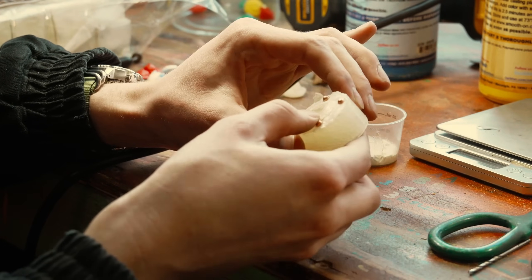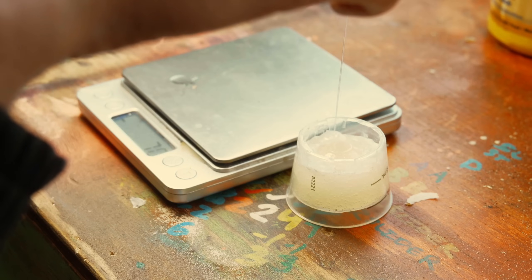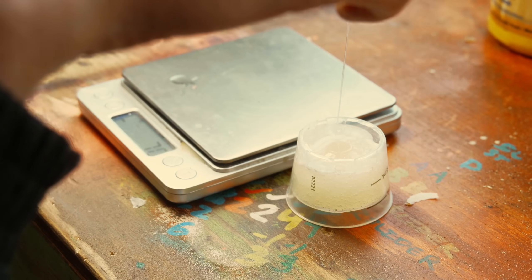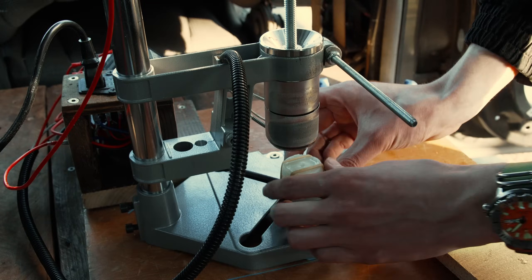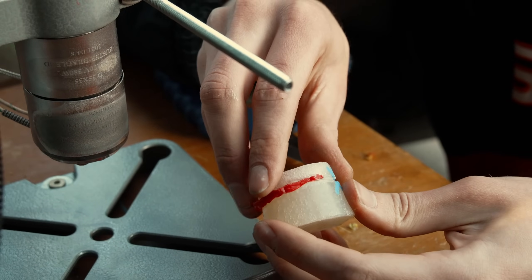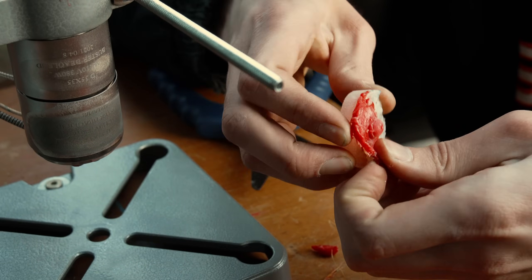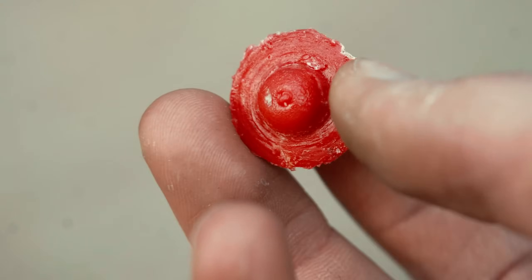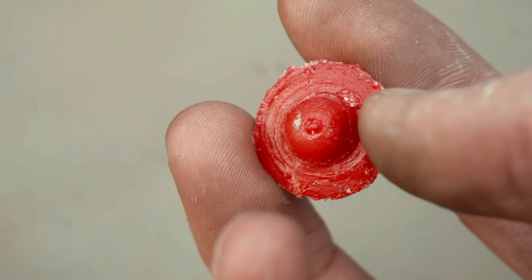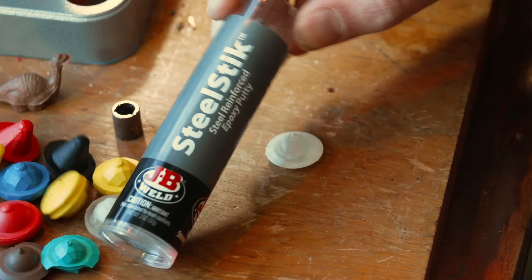It's possible that the melted plastic from the injection molder won't release from the two-part mold and the whole thing will get stuck together. This resin also isn't rated for particularly high temperatures, so it's possible the whole thing will just melt. To my surprise, neither of those two things went wrong, but I had two other things go wrong. Since I was using a two-part mold, I had a lot of plastic leaking around the edges. The entire part had terrible surface quality too because I used a resin that was about two years expired, but for a proof of concept it had some promise. So with the rigidity issue being figured out and surface quality being my new main issue, I'm going to try epoxy next.